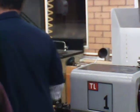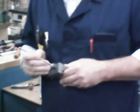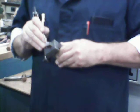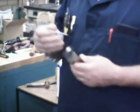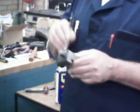What do you mean by brazed on? Let's see. This is actually a high-speed cutting tool. It's one of the chamfer tools. If it had a little darker gray edge right here, you would have a little tiny layer of brazing, which is usually brass. You melt the brass and have a flux in there that actually holds the carbide to the steel.